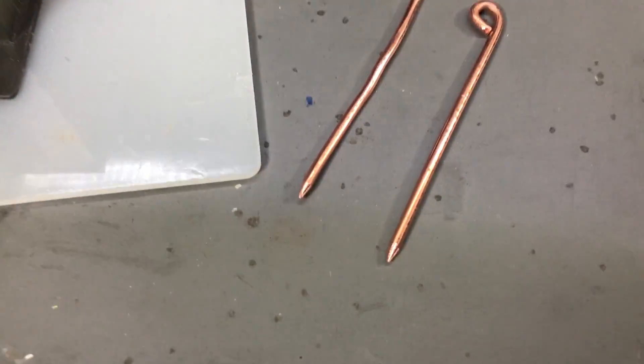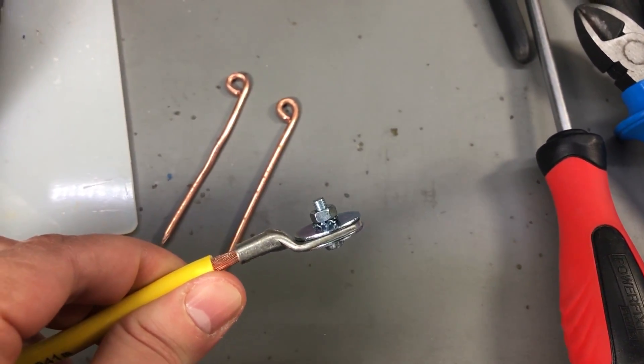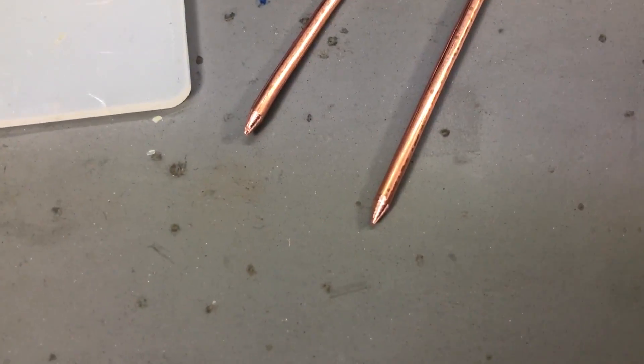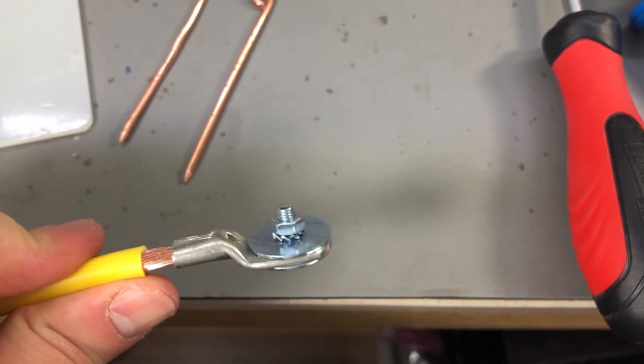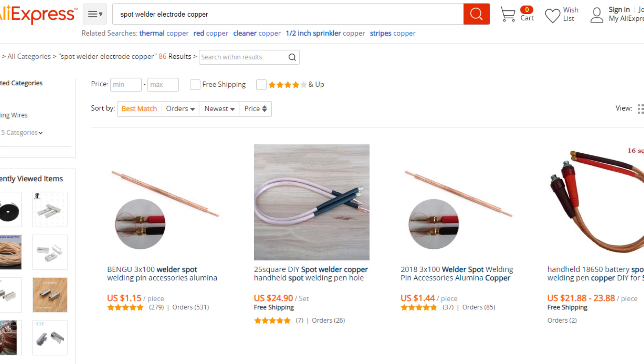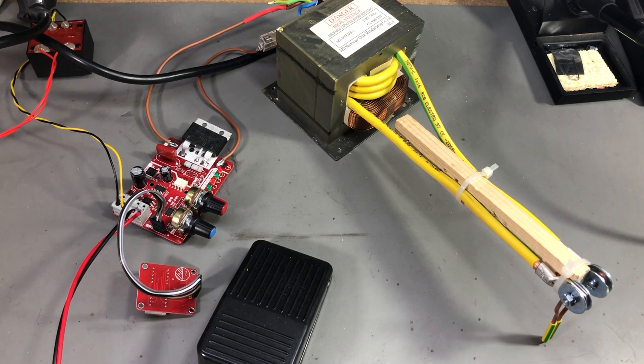I made my electrodes from the thickest solid copper wire I could find at the local hardware store — about 2.7 millimeters solid copper. This is not the best idea because electrodes should be made from a special type of copper alloy, not what you find in regular wire. This means the electrodes I built are good for testing but will cause problems for actual welding. You could order special electrodes from AliExpress, or make them if you have access to better-suited copper. You'll also need to build some kind of mechanism to attach the electrodes, so it starts to make sense to get one of those special spot welding pens that already includes that mechanism. I'll place a link in the description below.